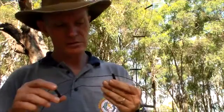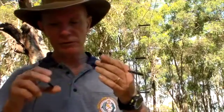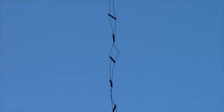It seems to do alright. I've used it on other antennas using different sorts of wire, so I'll be interested to see how this Don 10 performs. But being mil-spec, it's extremely strong, and it does the job for us out bush with the army. I've actually broken the Don 10, it's twin pair wire, into single wire, which makes it much easier to use for this application. Rightio, so this is the way the open wire feeder looks on its way up to the middle of the doublet.